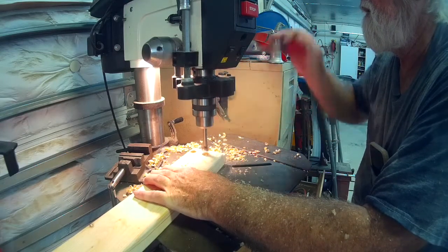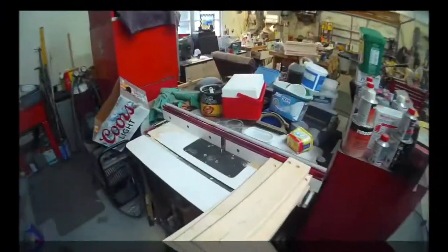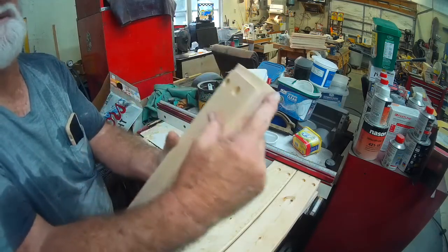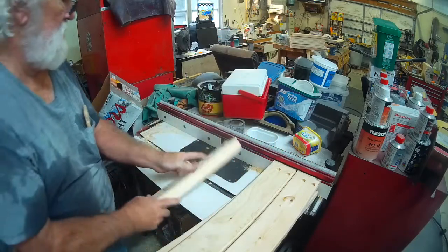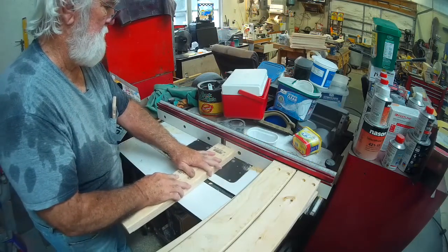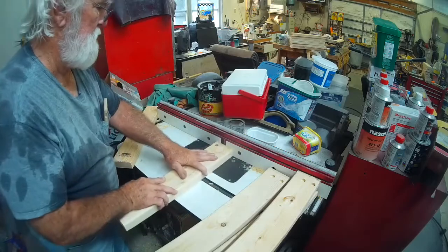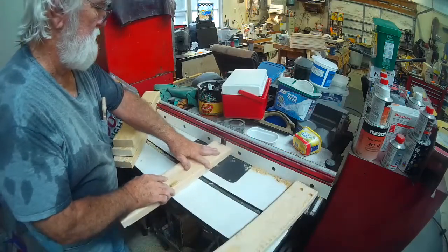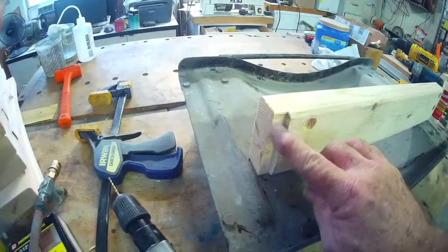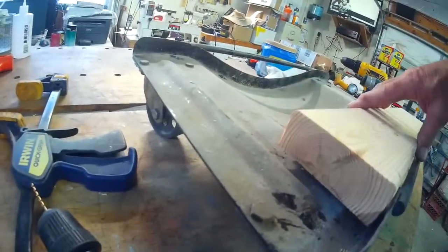Since the hole is already drilled, I didn't have a center hole I could reach, so I'm spending a little extra time getting it to line up properly. There's a ridge in the wheel dollies that keeps my cross beam from laying flat, so I've set up my router and tested it to fit. I already cut them but didn't cut them deep enough, so I'm rerunning all of them through the router and putting a rabbet in. There's the rabbet and there's the ridge I'm compensating for.